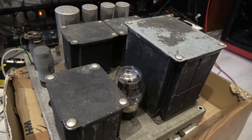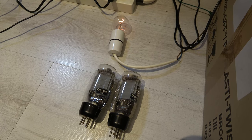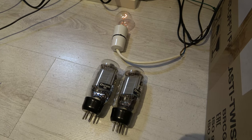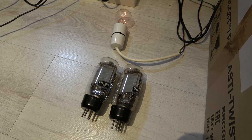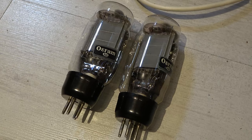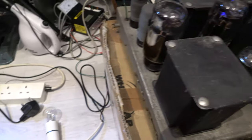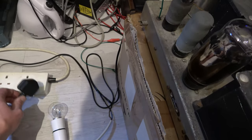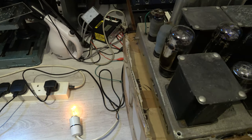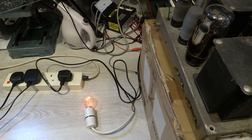Of course the big one is going to be putting the PX4s in. So here we have the two PX4s from my other RGD amplifier - they're about to go into the amp. I'm a bit nervous about this just in case it does something to these, because they're about 300 pounds a piece. But there's going to be a point I just have to try it because I've done everything else that I can with the amp. So here we have the PX4s installed. I haven't switched it on yet - and that's what I'm going to do now. So this is really the big kahuna. There we go - brightens up, dims down a bit. Should probably brighten a bit more as current's drawn.